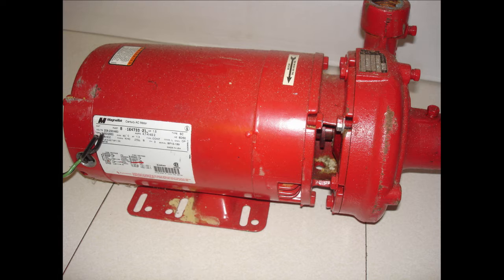And I say to the guy, "This pump is so oversized. That's why it's making noise. It's called velocity noise." So he says, "You mean we don't need a new pump?" I said, "No, I don't think so." I said, "Usually we could just put in a smaller impeller in here, which will cut down on the amount of flow." And I said, "In this case, the pump is so grossly oversized, we could probably just leave the impeller out and just run it on the shaft key." And he says, "You serious?" I said, "No, I'm joking, but thanks for considering it."